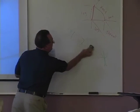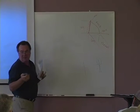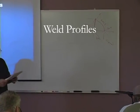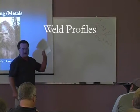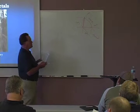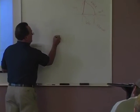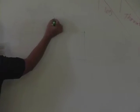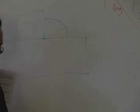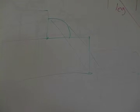If they do weld in tension areas, call us and we'll bring testing equipment out, do close visuals, and make sure no damage has been done to that flange. Regarding weld profiles — the first paragraph under weld profiles talks about convexity. This is primarily for where steel girders are welded to bearing plates. If it's a fat weld, that's convexity, and it typically needs to be less than an eighth of an inch. When you run calculations based on a 5/16ths weld, that's going to be less than an eighth of an inch sticking up. If you're seeing fat welds, give us a call and we'll come out, do close visuals, and run some calculations.